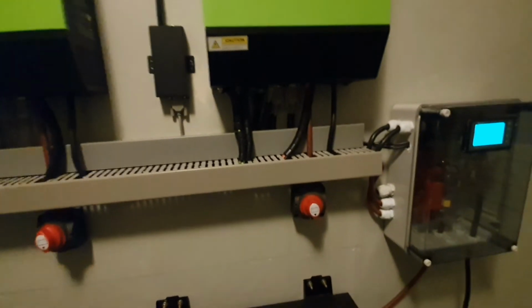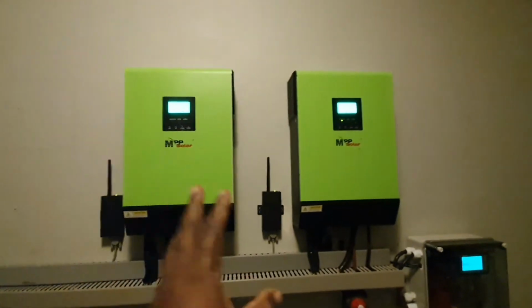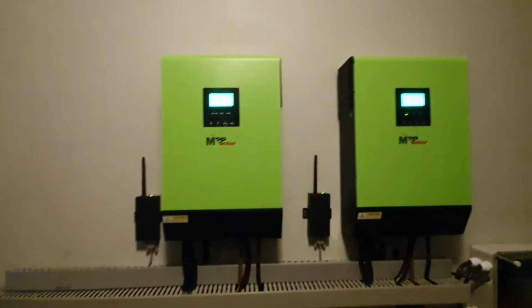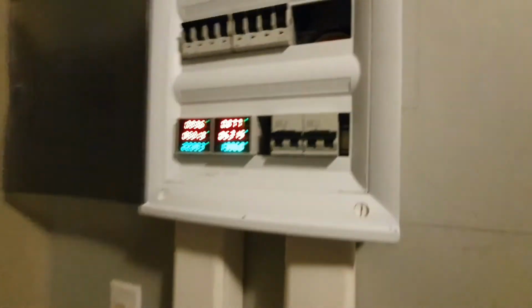So the batteries come here, connecting to this box where I have the battery monitor configured. I have the negative on the shunt going internal. Each of these systems is connected to a battery disconnect switch. I forgot to mention, with these units we can go to 9 of them. Same as the battery, where I can go to 6 of them, I can go up to 9 of them working in parallel. That's really good. And from here I go into my fuse box.